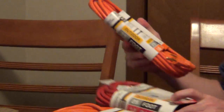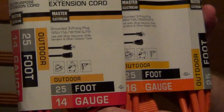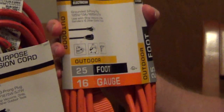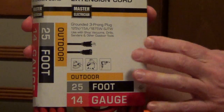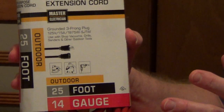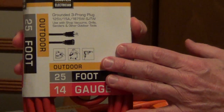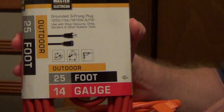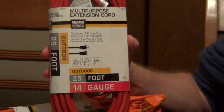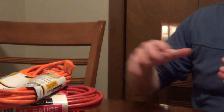The other thing is just the gauge itself. I have two 25-foot cords here — this one is rated for 13 amps, and the 14 gauge cord is rated for 15 amps. Most breakers in a home are 15 amp breakers, so for almost all projects you'll be able to use this cord. But again, if you had a longer extension cord it wouldn't pull as many amps.